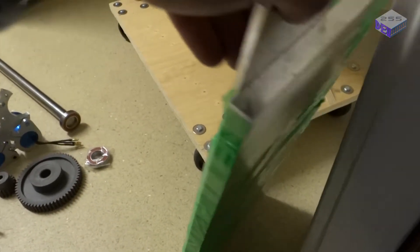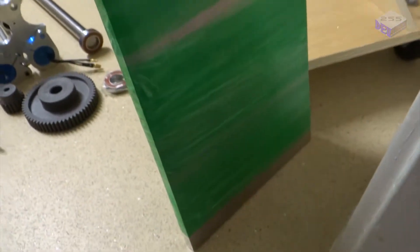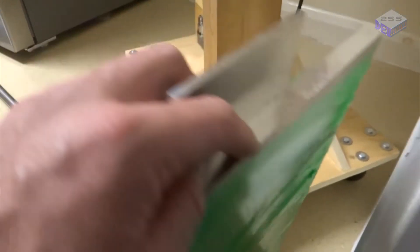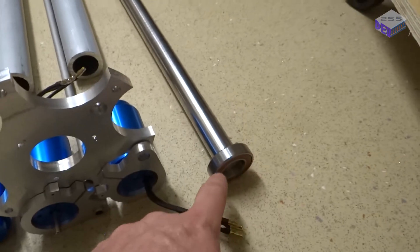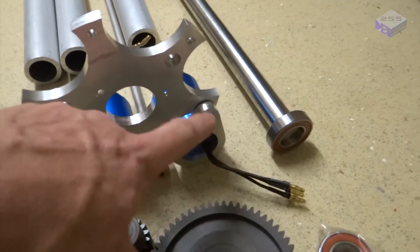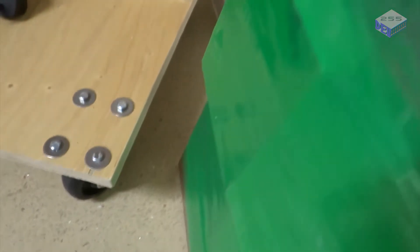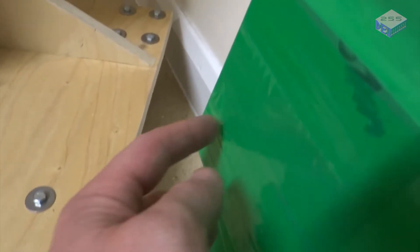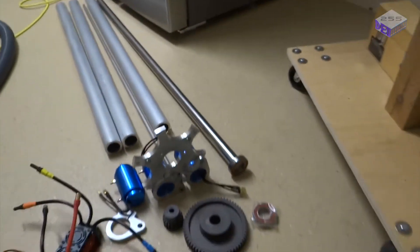I've got some aluminium here as well. This one here is a 15mm plate that will be used for the end plates — they'll actually support the three poles, the bearings, and everything else. All these rods come through here so there's plenty of points of contact. Then I've got some other sheets of aluminium, and this one is 25mm deep sitting in there — that'll be six collets that I'll make out of that, to fit onto these 25mm shafts. So that's where I'm at with that.